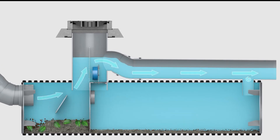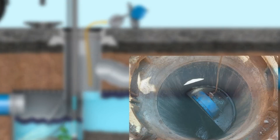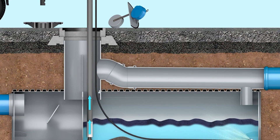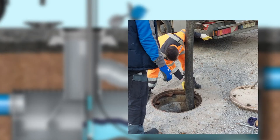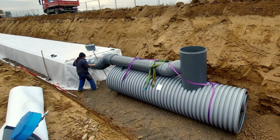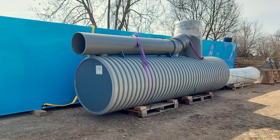As the water rises into the upper chamber, it encounters a spiral lamella, a clever structure that extends the water's path, causing lighter pollutants to settle out as well. This dual-action approach ensures that rainwater leaving the Funk system is significantly cleaner, reducing the burden on our rivers, lakes, and streams. Additionally, the collected rainwater can be stored and reused for various purposes such as irrigation, toilet flushing, or even industrial processes.